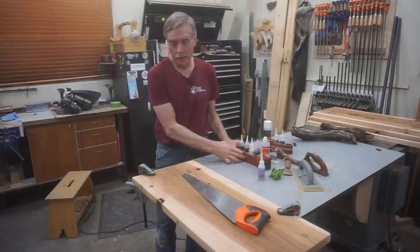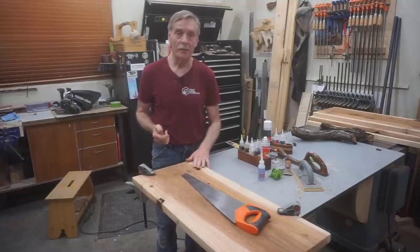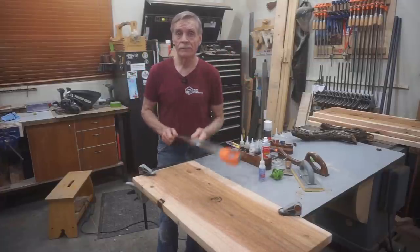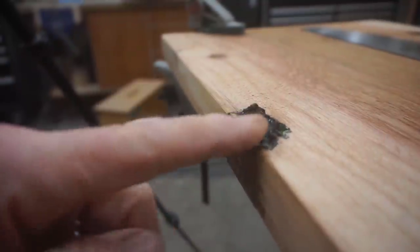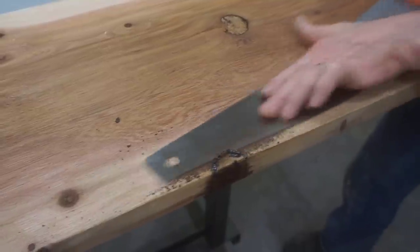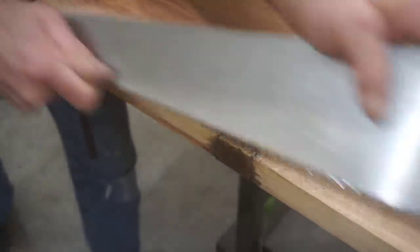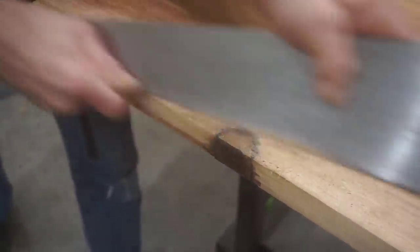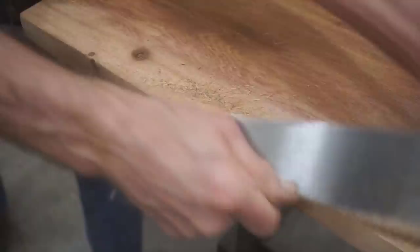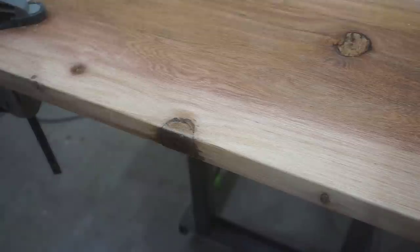With all the video work I've been doing on rough sawn cedar making a set of bunk beds, the way I finish up the repair on the front of this drawer front isn't going to be a surprise — it's quick, simple, and effective and involves a cheap big box saw. The surface of the repair is pretty gnarly and rough, but that's not a problem when using this saw to trim the repair flush and recreate the rough sawn texture. First I'll trim the repair flush with typical sawing action, then bow the blade and use a scraping action to recreate the rough sawn texture. I go over the repair with as many strokes as necessary to remove the smeared-lipstick look of the black CA on the surface, then switch to 80 grit sandpaper on a gator sanding block to ease the edge of the repair.